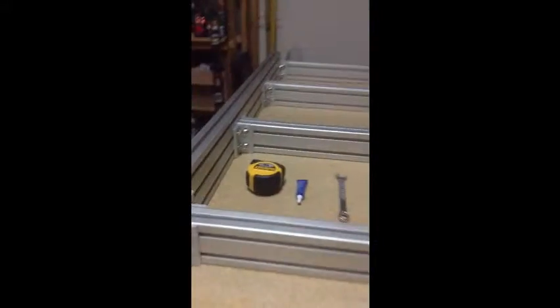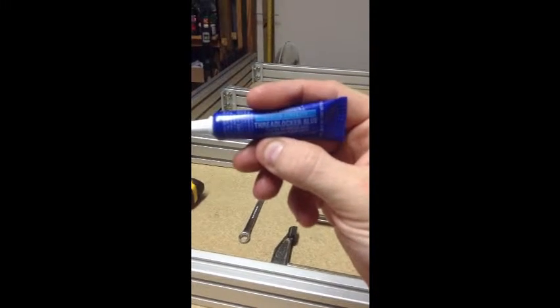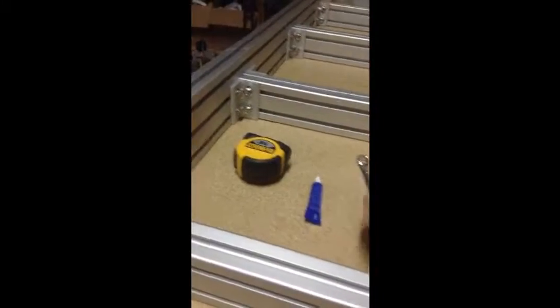Make sure that's done for each one of them. Every bolt that I did on here was Loctited. Here's what I used — just a little blue thread locker. It's removable, medium strength. Don't use the red stuff — it's super duty. I could not fit a socket in there, so just a half-inch crescent wrench works good too.